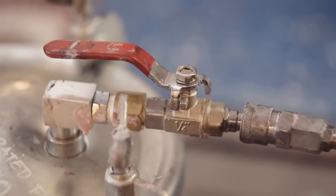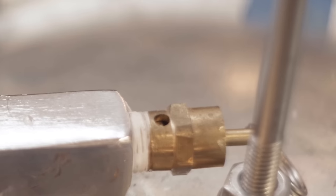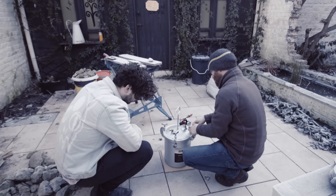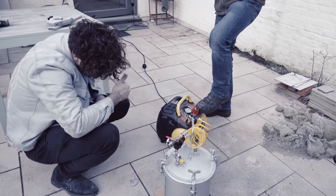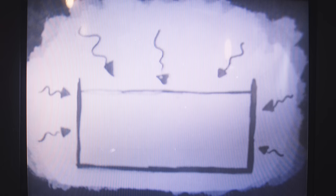Air goes in from the compressor, this gauge tells me exactly how much pressure has been built up, and most importantly, there's a safety blow-off valve which stops the pot from turning into an explosive if I accidentally add too much air. This is me and my friend Tone testing his homemade pressure pot for the first time — he made it, and my limbs and I tested it. That's friendship. A pressure pot makes any remaining bubbles in the silicone teeny tiny, which is good for fast-setting silicones that you might struggle to de-gas entirely before they start to cure.